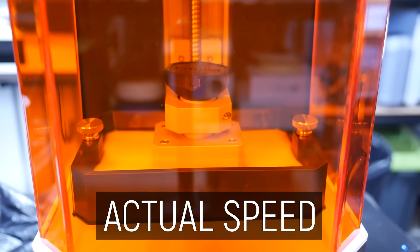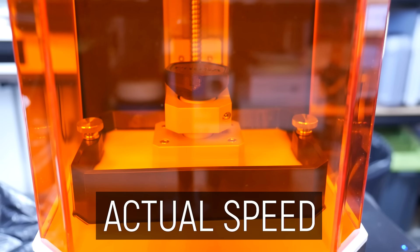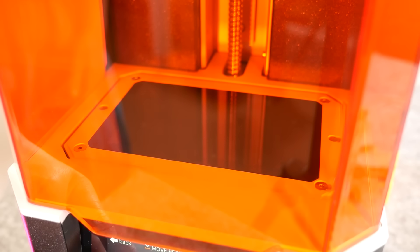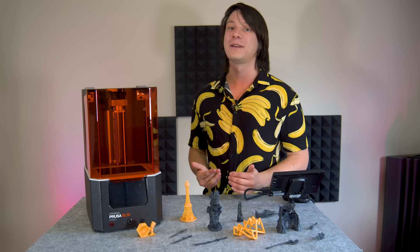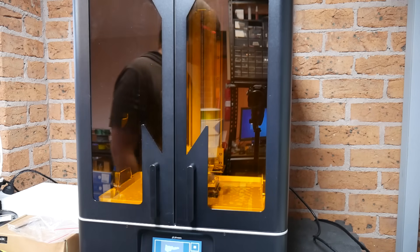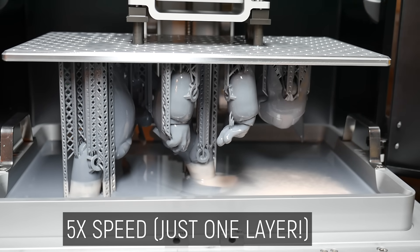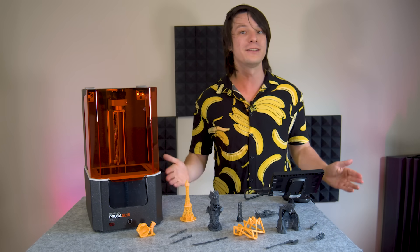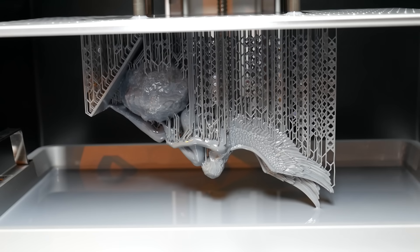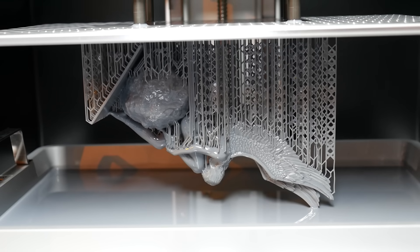The most obvious thing that grabs your attention when this machine is running is just how insanely fast it is. It absolutely lives up to its name. The mono LCD not only reduces layer time down to under 2 seconds for 50 micron layer prints, but because the bed mechanically tilts to free the cured part from the FEP in preparation for the next layer — instead of slowly lifting vertically — the layer change time is also way faster than anything else I've used. I recently tested the Sonic Mega 8K, and that machine is a slow-moving dinosaur compared to the print speeds of this machine. The 8K does have to contend with potentially way larger peel forces, so fair enough, but that means for safety they need to run that layer change cycle very slowly — even for smaller prints it's quite slow — but this thing just hammers.